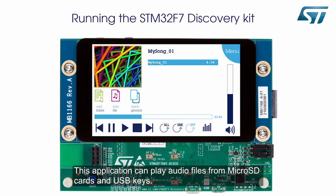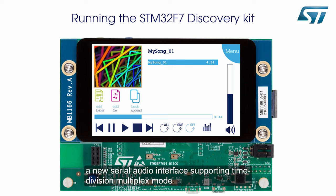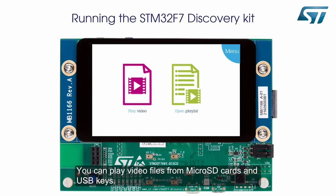This application can play audio files from microSD cards and USB keys. The STM32F7 MCU has two dedicated audio PLLs, three half-duplex I2S interfaces, a new serial audio interface supporting time division multiplex mode, and a digital filter for a Sigma Delta modulator or DFSDM module. The STM32F7 Discovery Kit also includes a video player application. You can play video files from microSD cards and USB keys.